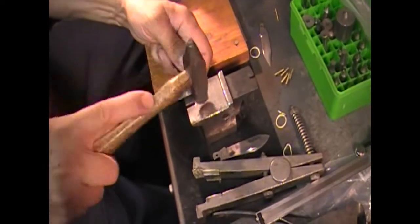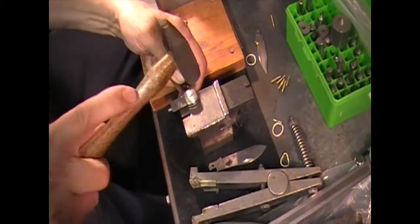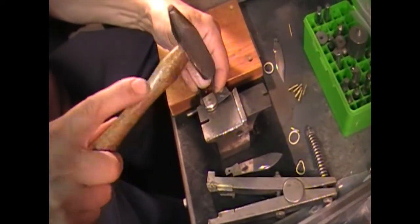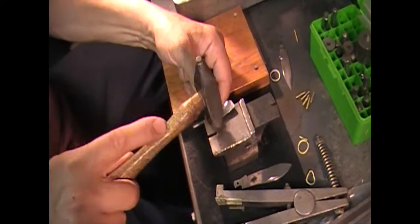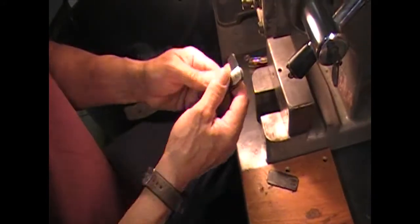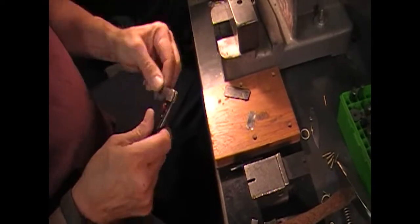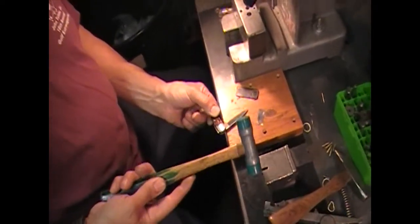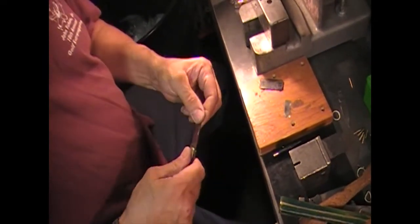I think these pins are pretty close, so when you finish it off it should be a good shape. Now you can go as far as you want. If you go too far it will be really tight when you pull your slacker out and you'll have to rock it, which always takes a chance of breaking something. Basically you just want to make sure you've filled that counterbore. I got a pretty good head on both sides. Now it's pretty tight, so what I'll do is just rock it a little bit with a plastic hammer — hit that side, hit that side. Now it's perfect.